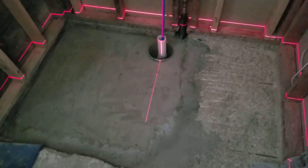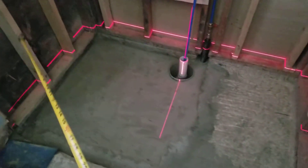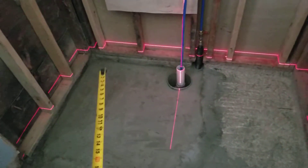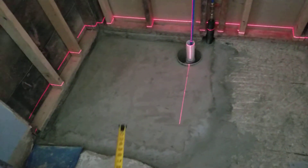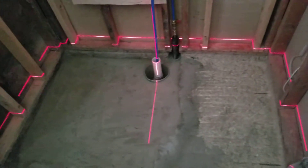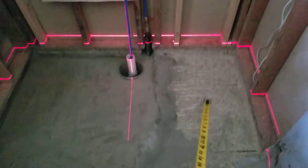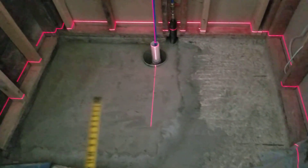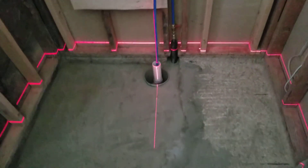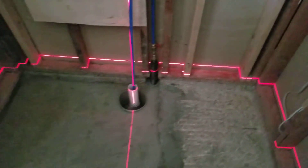When you put the mud down for the pan, you've got to put extra so it seeps up into the ribs in the pan. I'll measure down to those boards — that's why I'm going to run a couple of shim boards across there. You've got to get it level, and I'm going to be floating it in. This side I'll be able to push down; without a couple of boards I wouldn't. I want it pretty damn level — side walls, rear wall — everything pretty damn level when I get this pan set. It's going to make everything else so much easier.